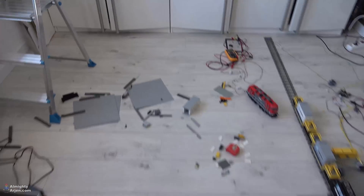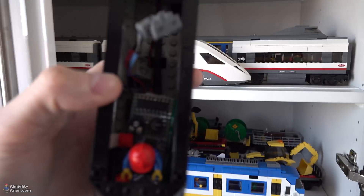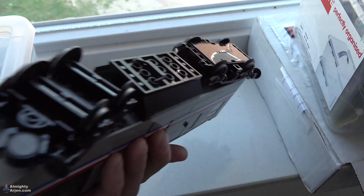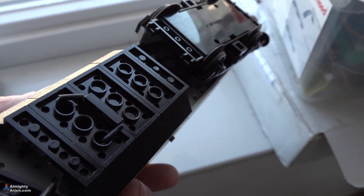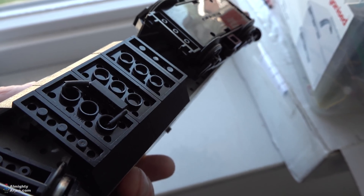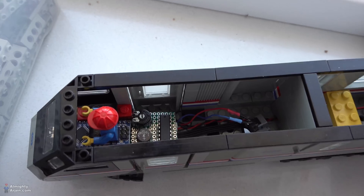Let's have a look at all the mess in here — I still have that train, I haven't had time to fix it or remove the control system. If you look at the bottom of the train — let me put it in the light — there you see the magnetic sensor sitting there. This is the reed switch I used on the high alpine Lego train, and inside you can still see the control system that made the train stop.